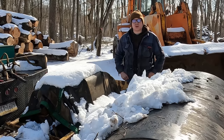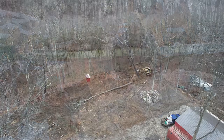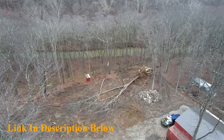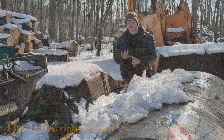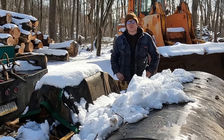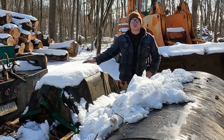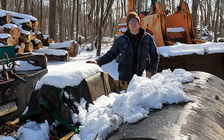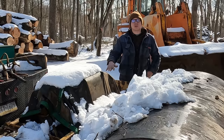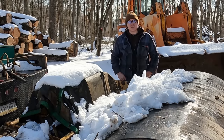As most of you guys that follow the channel probably already know, I've started the process of clearing for my dream shop. I'm going to build a big workshop out here like I've been dreaming of doing since I was a little kid. So I'm pretty excited about that, and I can't do much right now because there's snow on the ground. I can't be cutting and grading. But I have the site cleared, and so the next thing I need to do in preparation for the building is get the grade all done. So I'm going to have to cut off topsoil, cut the subgrade down the way I want it, and then I've got to really compact the living crap out of it so that the building doesn't settle in the future. And then on top of that, I'm also going to have to put in a good bit of fill, bring the building up to the elevation that I want it to be. So to do all that, you need a good compactor.